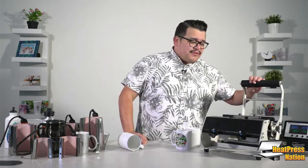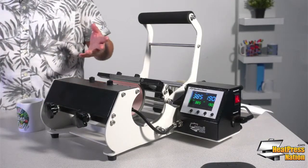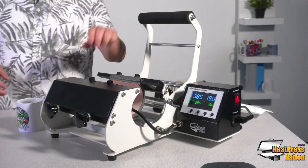So I'm gonna see if we have any questions here. Craig Bradley's asking, how many can you realistically do in an hour? If you were here for the beginning, you saw I loaded a mug in, and in the time it took me to press one mug, I had already cut and prepared my second mug. The beeping sound is the machine telling me, hey, I'm on, don't forget about me. To get that to be quiet, you just lower the handle once and it'll stop. So you could realistically keep this thing running. The in-between time is anywhere from 10 to 30 seconds for you to pull one mug out and drop the next one in.